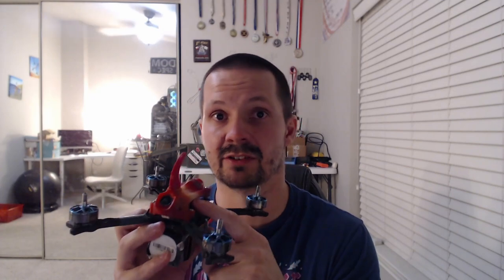Assuming you already built your drone or bought it, plugged it in safely with a smoke stopper, the flight controller is getting power, you got beeps from all motors, the receiver is getting power, the VTX is getting power, the receiver LED shows it's bound with your radio, and you've already set up aux channels and switches in your radio. The first step is very important: take your props off. Zero props on the drone.